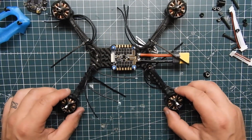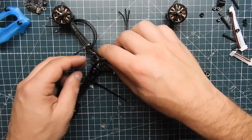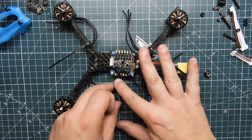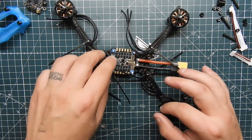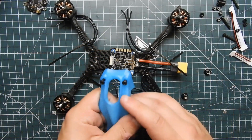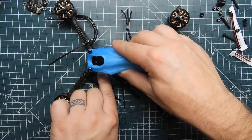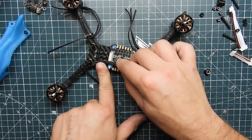I don't see any contact, so we're good. Now for how we're going to solder this up — it's going to be a little different than other builds. I want to take the wire and go through the inside and then solder it up from inside. That gives more protection to the wire in case something hits it on the outside, and it looks cleaner. I just have to pay attention to the canopy overhang, so we have to come down on the side there to make it work.